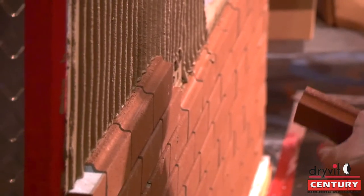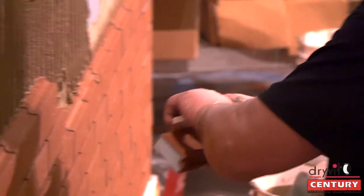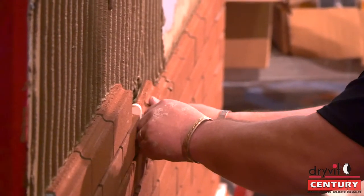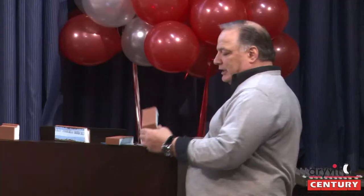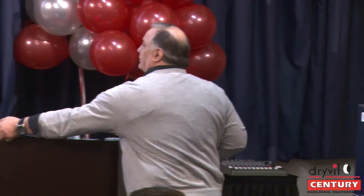The corner brick and end brick do not include the spacing lip. We are looking into a different method — mitering the corner brick and finishing it using foam-to-foam — and if that happens, there will be a spacer on the return. But for now, use spacers as you see Eric doing.